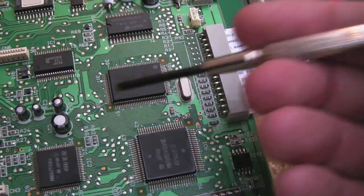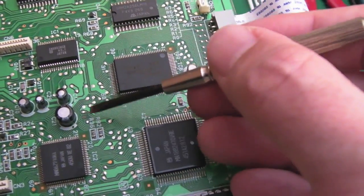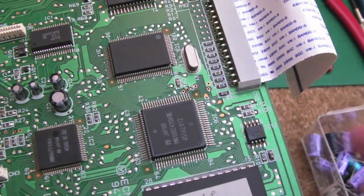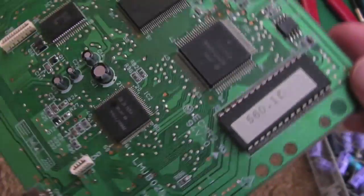I'm getting some read errors again. I think that's what it is — it's been in storage for a while and I haven't used it. So I'll remove that cap, clean up around there with a bit of solder flux and some de-solder braid, reassemble it and test it.